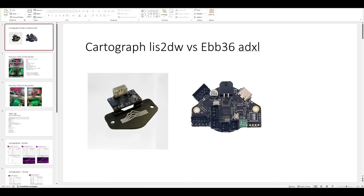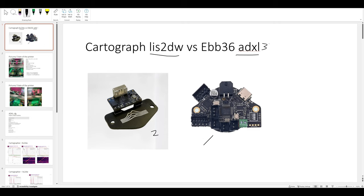Good morning, good evening. So today I just got done installing the Cartographer and I've seen a lot of discussion on the Resonance channel and Voron Discord. I wanted to see for myself what it's all about and does it affect our resonance with the chip. There are two I use to compare: the EBB36 and the Cartographer. They have two different accelerometers - the Cartographer uses the LIS2DW and the EBB36 uses an ADXL345.